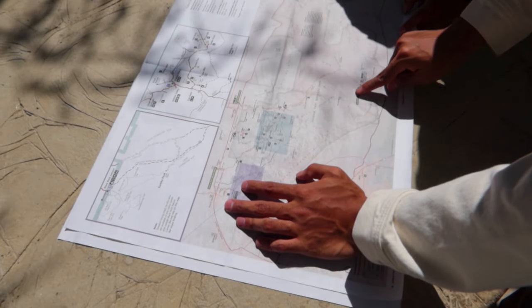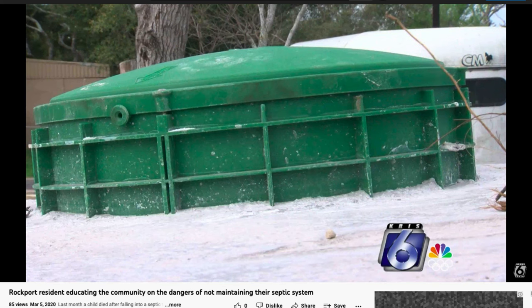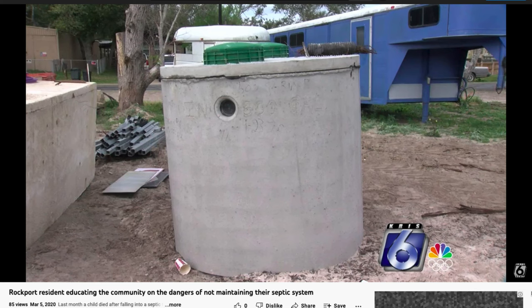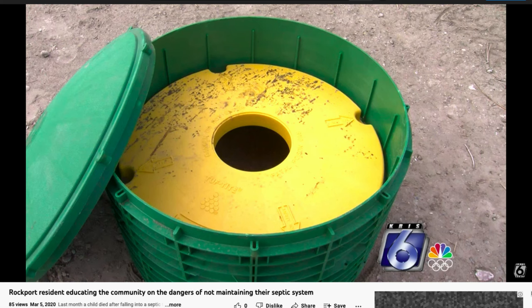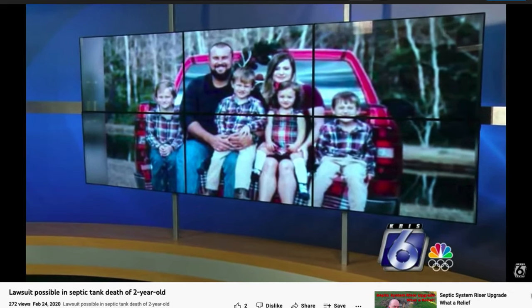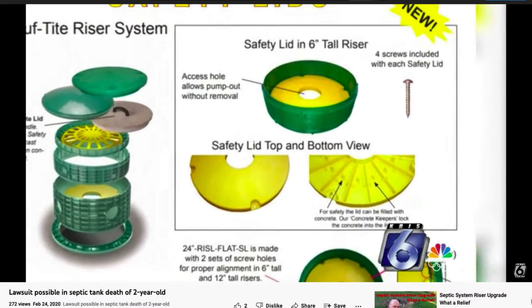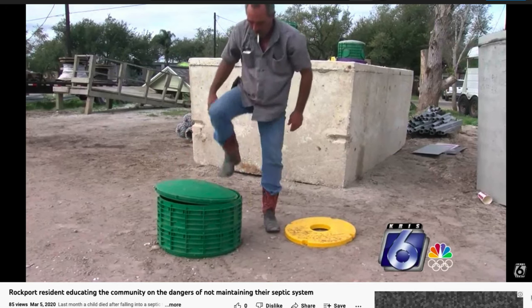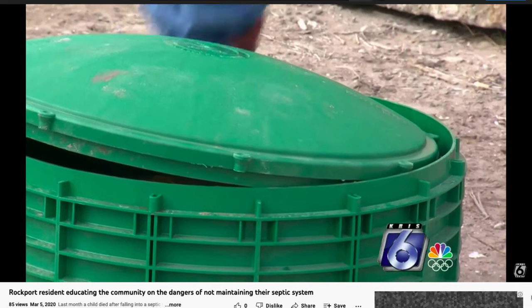Be very careful if you plan to install a new septic tank cover and riser yourself. I'll go so far as to say don't skimp on professional services when it comes to any part of your septic tank. If you do install a septic tank cover that is unburied, it can become a real safety hazard if it is not secured properly. In particular, if you use one of the common green plastic septic tank covers, make sure both the inner ring and outer lid are anchored by all 12 safety screws. Otherwise, the lid could flip open when a pet or child walks on it, as tragically happened at an RV park in Florida, causing the death of a toddler. Don't neglect your septic tank or its lid — you want to make sure that the septic tank remains safe, functional, and boring.